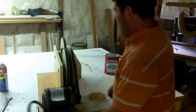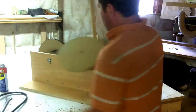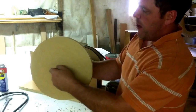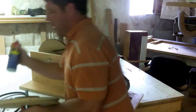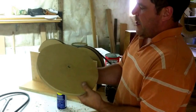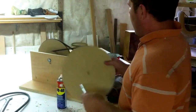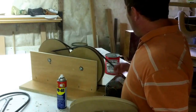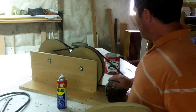All I did was make simple wooden pulleys. They're just running on bolts — on the very smooth part of the bolt. What I did was drill these out, then sprayed them with WD-40 so the inside of the MDF wouldn't soak in any more. Then I just put this together, so it's literally just running on a few bolts, and I'm amazed — this thing is transferring the power very well from this one-third horsepower motor.